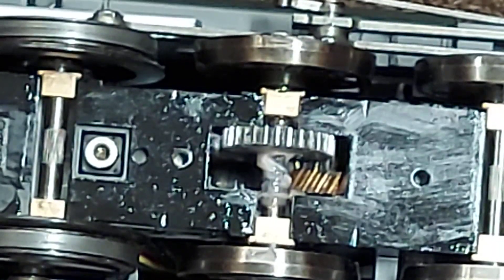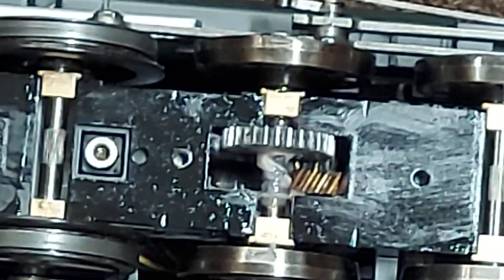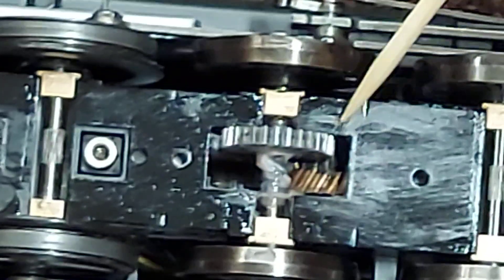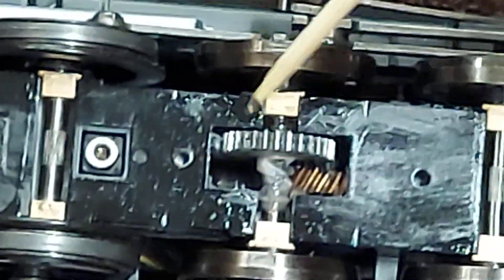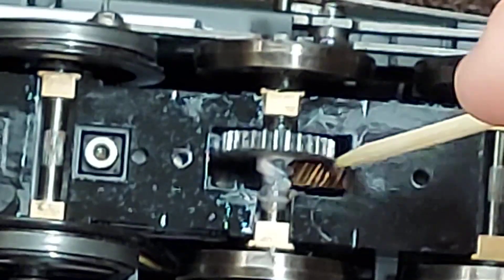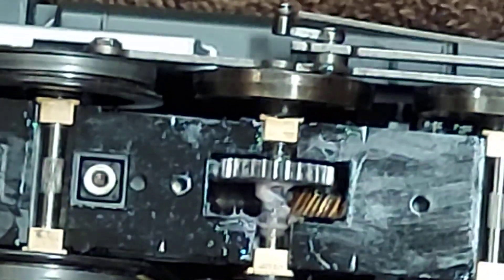On the H10 it's really easy to get the bottom plate off — it's older tooling that Lionel designed where the bottom plate is separate. There are four screws across the bottom of the chassis; remove those plus the two current collectors and the whole bottom plate comes off. Inside the gearbox you can't see the worm because the locomotive is inverted and it's all the way at the very bottom. But here's your axle gear, and here's the gear on the shaft that's turned by the worm gear, and then there's another gear next to it that you can barely see.